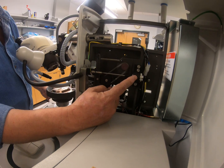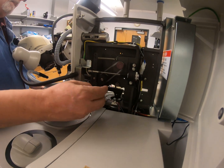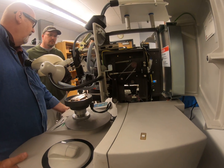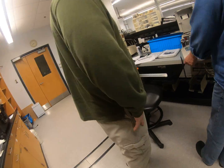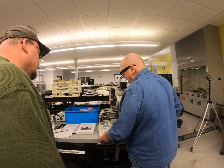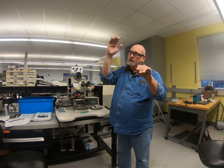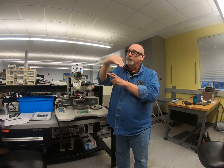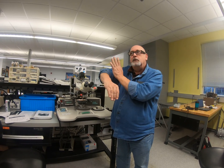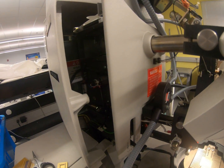So this is your feedback loop — servo motor and feedback loop for positioning. On the back of this rod is something called an air dashpot, and that's nothing more than a parachute-type feature. This is not a direct drive system, it's an indirect drive. The cam moves forward, moves the cam arm forward, and allows the head to fall. The head is not being driven by the motor — it's just being allowed to fall, and only falls as fast as that air dashpot will allow it. It's a shock absorber, a parachute, a soft-touch feature.